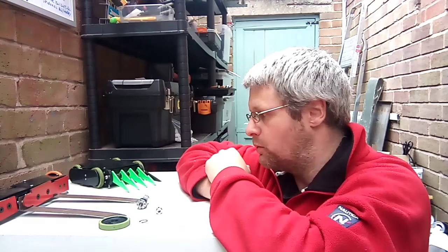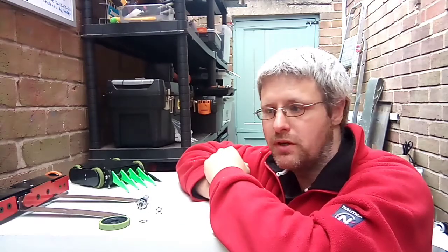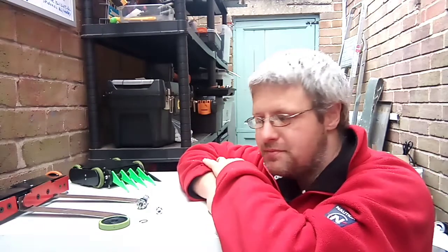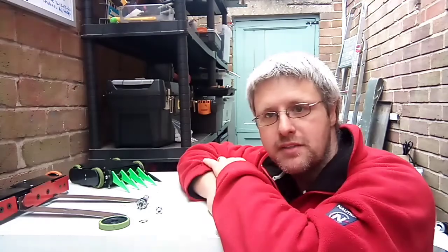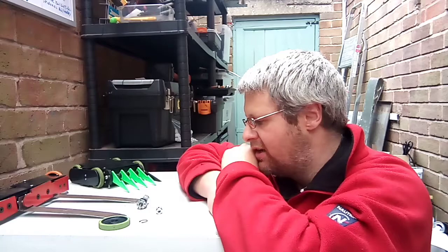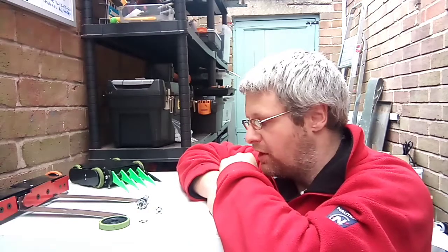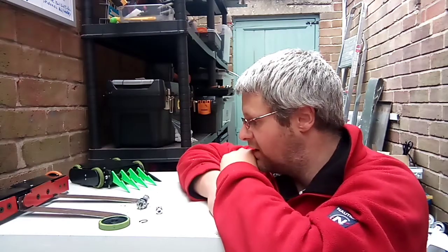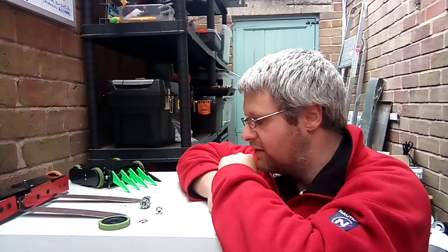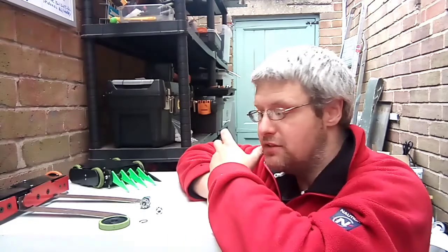So after the first few fights with Claws 2 at the first event we ran it, the grub screw was working its way loose and the motor was just spinning, not moving the wheel. And they told us about this little improvement. I'm going to go over that with you today, and some other little things you can do to help with these wheels falling off.